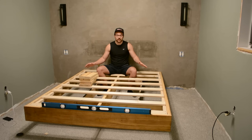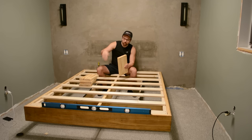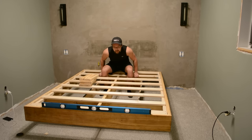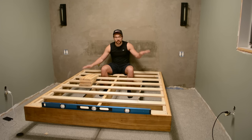With everything in place, I made sure it was level before securing it. I'm taking four 13-inch blocks and installing them in each corner of the smaller box underneath the larger bed platform to secure the two boxes together. I'll put in about three or four screws on the top and three or four on the bottom, and also add toenail screws as well as screwing the top platform into any studs I can find in the wall. We're being overkill with the screws to make sure there's no rocking, and that the bed won't tilt if someone sits on the very edge.